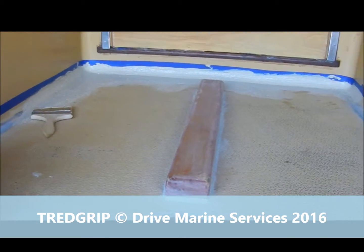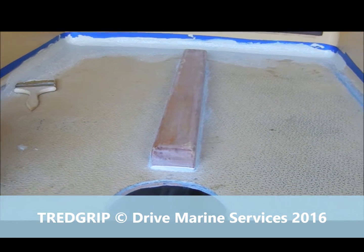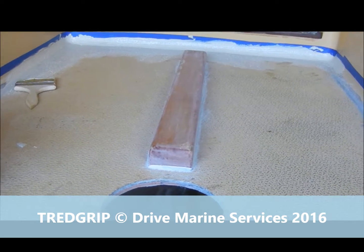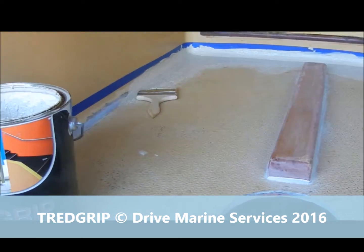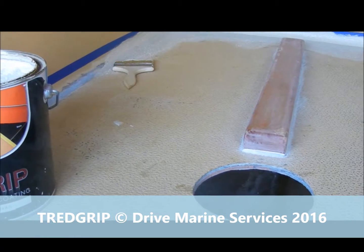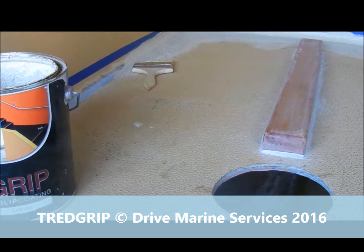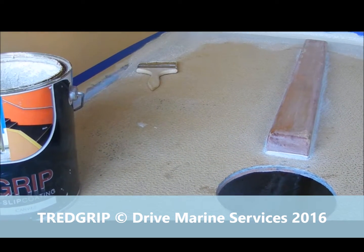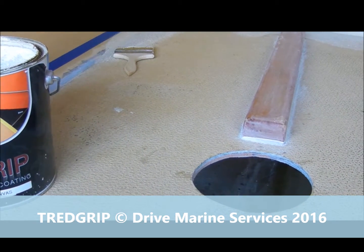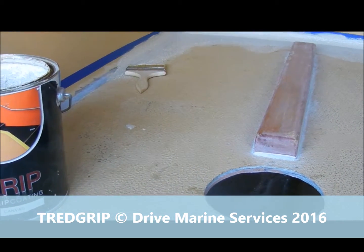I've done a little bit of tread grip up the front there — front of the cockpit — and I'll work my way back to the back of the cockpit. First coat we're just going to put it on with a brush and I'll be very liberal with it. This paint is designed to go on fairly thick. If you try and spread it too much you'll find you'll pull the rubber out — it's got synthetic rubber in it. It's brilliant non-slip paint on wet surfaces, but if you try and spread it too thin it bunches up the rubber and it looks ugly. So nice thick coats on with this and away you go.